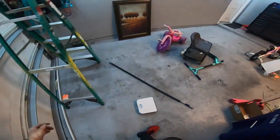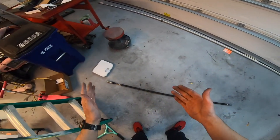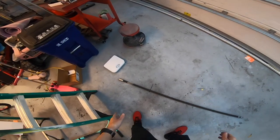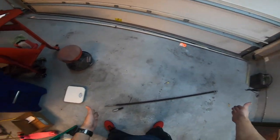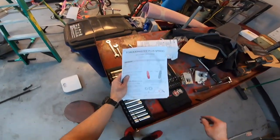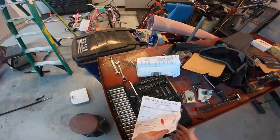It's really long so you're going to have to move it around in your garage. What I need to do is switch the springs around, and what you probably need to do is pull out your broken spring and replace it. This is my broken one here. When you order new springs, they're going to be different - this one actually has a rod in it. The springs will be different lengths than the originals; they're actually a lot shorter.